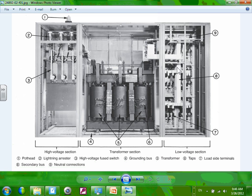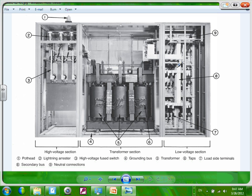There's a better way of doing the system. So what they do, like we did the Gonda building for Mayo Clinic, that's exactly what you're looking at, is exactly what we installed. What they do, guys, is really easy. You bring the feed, either from the top or the bottom. What we did is we brought it from the top. So we bring the high voltage from the top, so that would be 13.8 kilovolt, and then we came through the transformer.